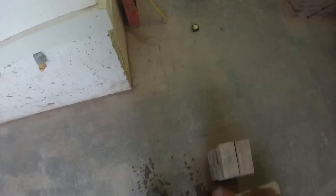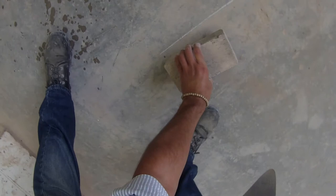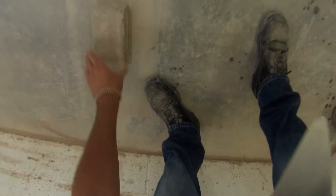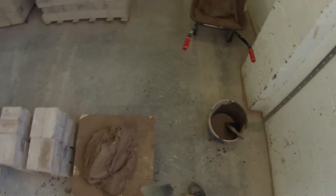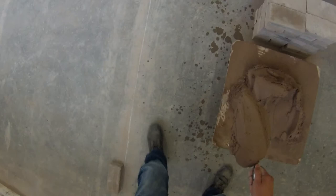You're pretty much ready to start your work now — everything's to hand. So if I pick my trowel up, you'll notice that the line of the wall is that side — that's the face of the wall. If I were running a garden wall here, I could set my bricks at each end, and when I start running through, everything's to hand. I don't have to walk to pick my mortar up, I don't have to walk to pick my bricks up. I can pick my mortar up off my board without really having to move my feet, and pick my bricks up at the same time. If I need extra mortar for joints, it's there — it makes everything quick and simple. And that's a basic set out.